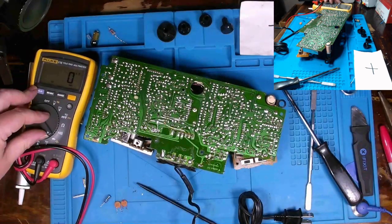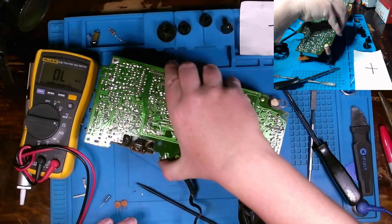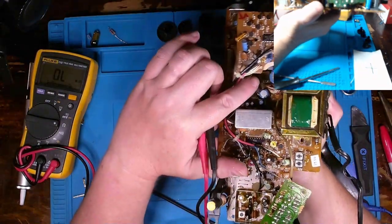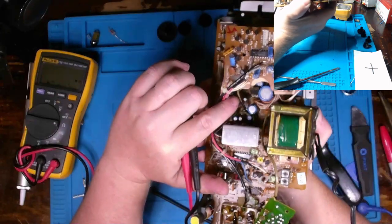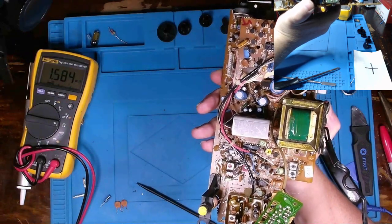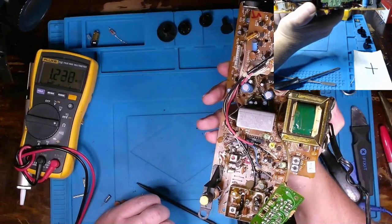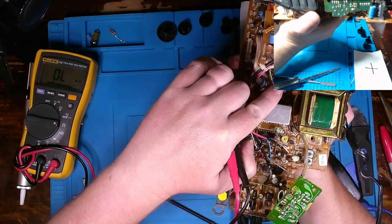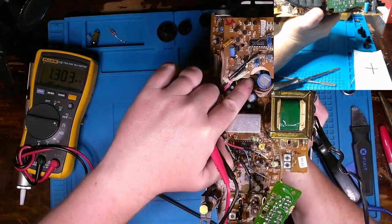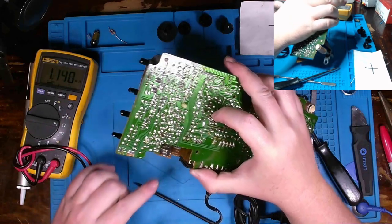Something else. Let's take a look at this transistor here. Now that B507 is actually a PNP, okay? I said NPN earlier, I'm wrong. And when we look at it from the face and the first leg on the left, count over, PIN 1 should be on the far left, and that should be our base, followed by our collector on pin 2 and emitter on pin 3. So pin 1, pin 2, pin 3, left to right on this guy right here. Which means that pin 1, I marked it up here, is this lead right here.